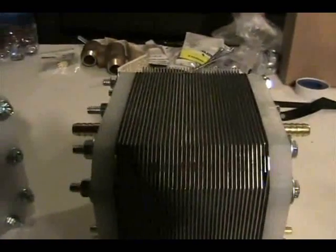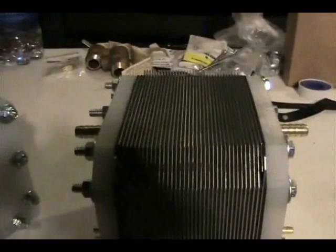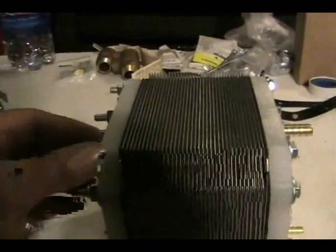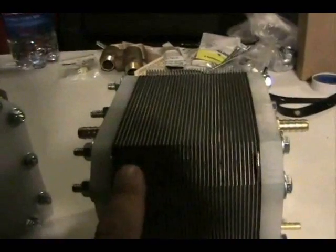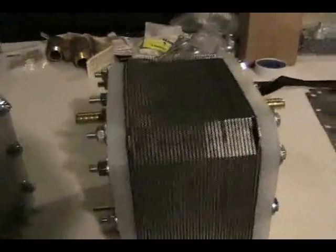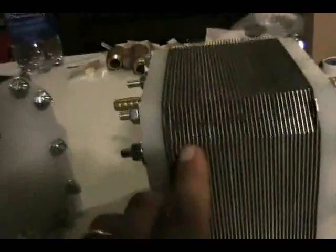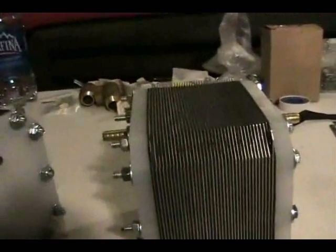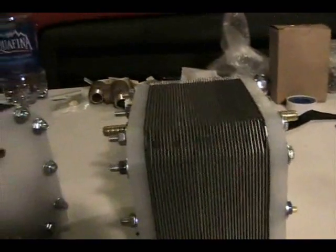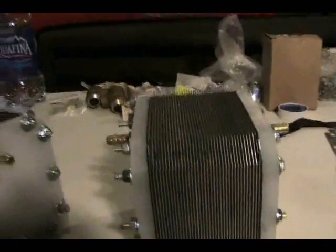This would also be known as a series cell. The difference is a parallel cell is positive, negative, positive, negative. This is similar in that it still has a positive and negative, however your connections are series — you have a connection at this plate and a connection at this one, and the rest of the plates get their connection through the electrolyte. So the connection points are series, versus a parallel which would have a connection on every plate. If two plates are closer together than others within the system, the optimum voltage will be slightly different than the rest of the cell. So the more uniform you keep your plate distance, the better you will be able to run the cell at its efficient point.